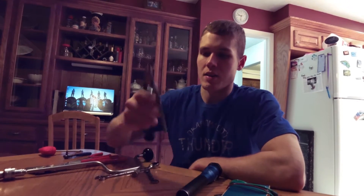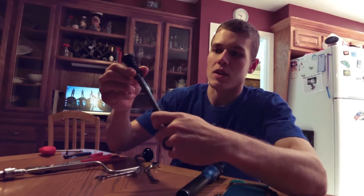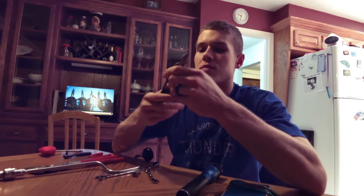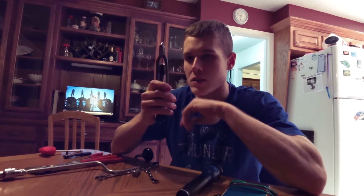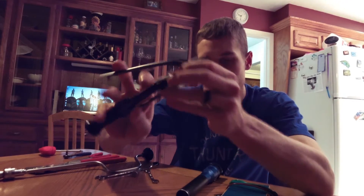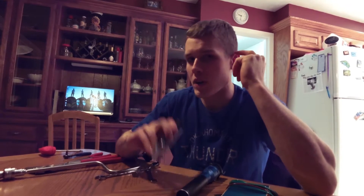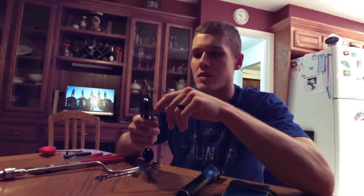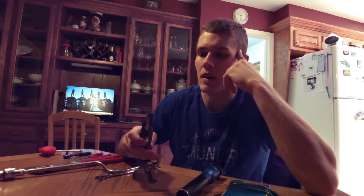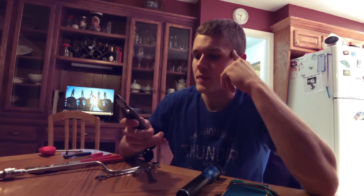Next I've got a pair of safety wire pliers. These are the reversible style, so you've got your right and left position. It's got the automatic retracting handle on it. It's got the little cushion on the throat of the cutting portion to hold your safety wire. These are not 100% necessary, but it's going to make you a lot faster than using duck bills or twisting safety wire by hand. Every aircraft mechanic pretty much has a pair of safety wire pliers.